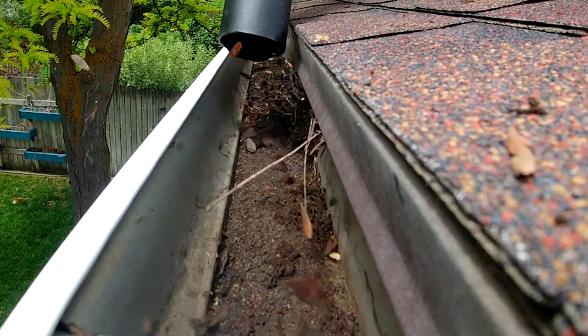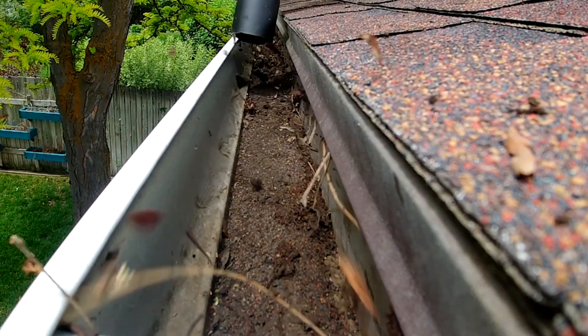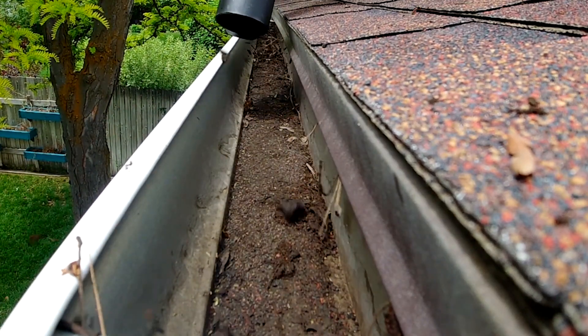First things first is to clean out your gutters. You do not want to wait until we are fully into the rainy season to worry about your gutters being clean. If there is too much debris in your gutters, you do risk the chance of those gutters becoming too heavy and detaching from your home, which of course leads to a much larger and more expensive project. So while you have some time when the weather starts to warm up, get up there on your roof or hire someone to do it for you and get those gutters cleaned out.